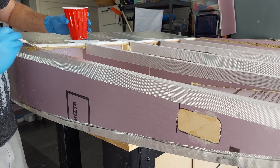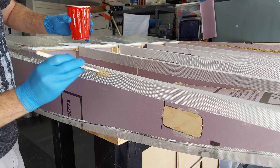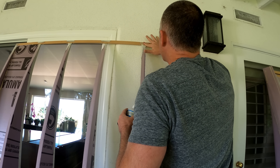To improve the bottom cap strip process, I simply oversized the fiberglass strip and epoxied only the upper portion, leaving the rest to hold everything in place while curing, then came back and removed the excess later. I also used super glue to secure the fiberglass to the trailing edge.